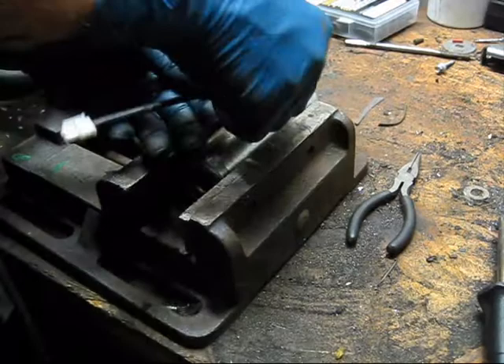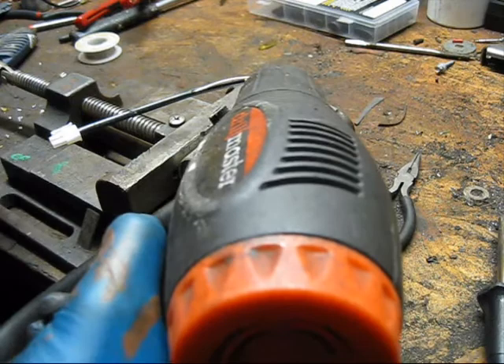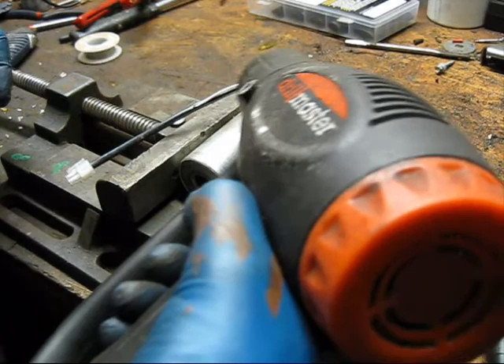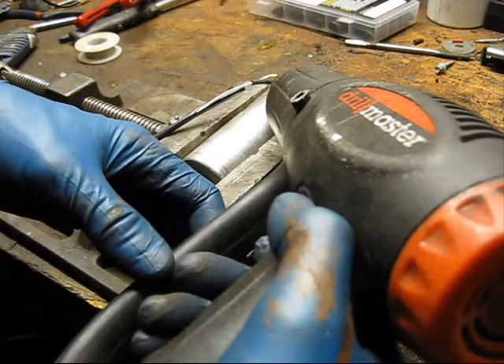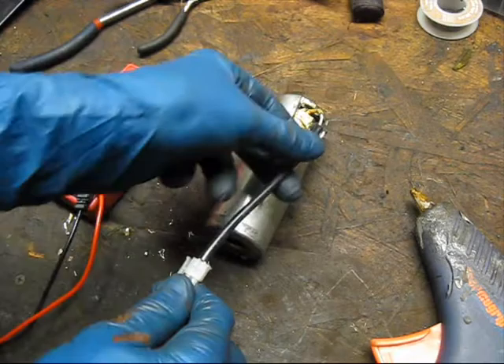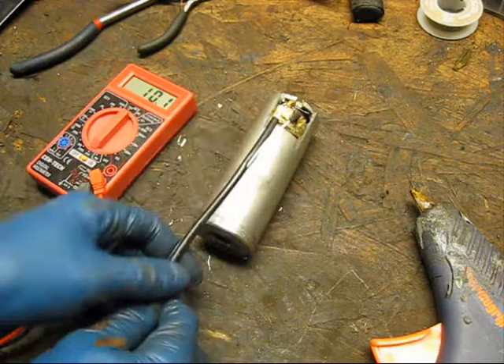The soldering's done. I'm going to go ahead and put the heat shrink on now. This is adhesive-lined heat shrink, which is probably overkill for something like this, but I'd like to have that extra adhesive just for a stronger connection in this particular situation. I'll go ahead and check this with my meter real quick just to make sure it worked. Yep, we're getting a reading. Just wiggle it around, make sure we don't have any opens or breaks in the wires or a short. Looks like it should be good.